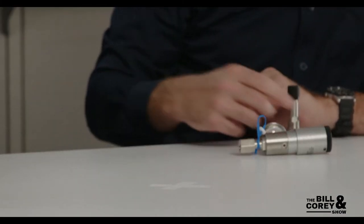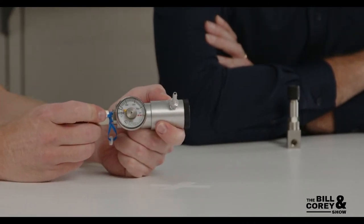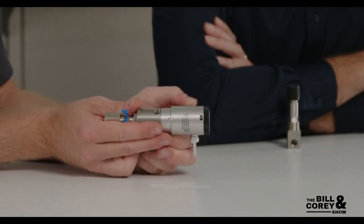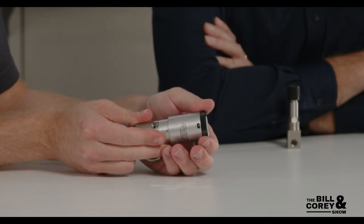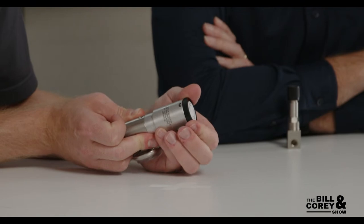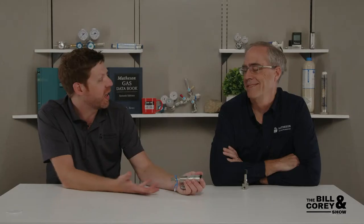If they want higher pressure, this is a calibration gas valve. What's nice about it is there's a zero position — it's actually a flow regulator. You get 0.5, then 1.0, then 1.5 liters per minute. If you want something between those two values this might not be ideal since you're on one end or the other, but this can handle 3000 psi inlet and the outlet will be low pressure — calibration-style gas low pressure. Those are your two main options for that customer.